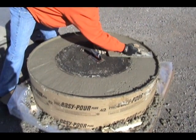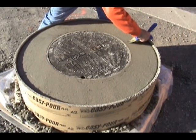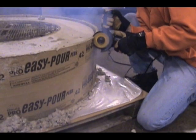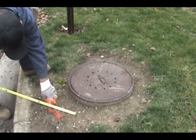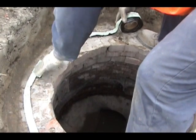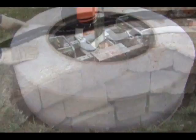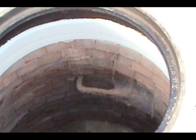We'll be putting a slight slope on the top of the structure. Remove the Sonotube or the cardboard ring, clean up any rough edges, and the structure will be ready to install. Mark out the excavation slightly larger than the structure. Apply the mastic and the Mr. Manhole sealant — these products are both available from Mr. Manhole. Set the structure down on top of the cone, replace the lid, and backfill.